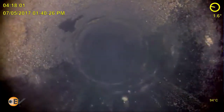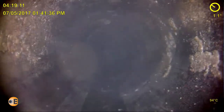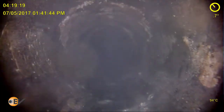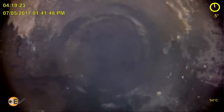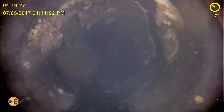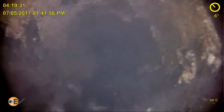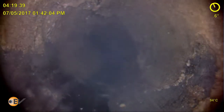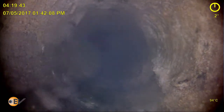The video clearly shows the production tubing has significant salt deposits blocking the perforations and progressively getting worse the deeper the camera goes. With the assistance of the collapsible bowspring centralisers, the 1 and 11/16th OD toolstring could enter the lower section of tubing and continue to run in until the hold-up, confirming an almost full-bore salt bridge.